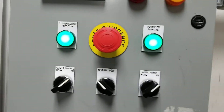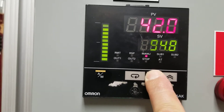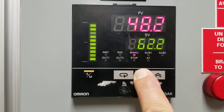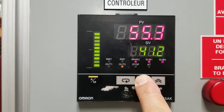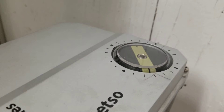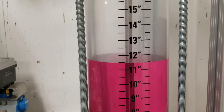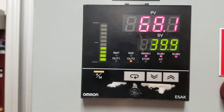We want to make sure we have mass balance between inflow and outflow. So what we're going to do is lower or close our pneumatic valve. Usually it's best to start at around 40% open — the longer you keep your finger on this, the quicker it goes up or down. So I'm going to put this to 40. You'll see the valve is going to kick in after 2 seconds. That's open about 40-50%. Now I've overshot 5 inches, but that's fine. It's still going up, which means with my pneumatic valve open 50% and my drain valve open 50%, it's still rising. So my magic number here is a little too high still.